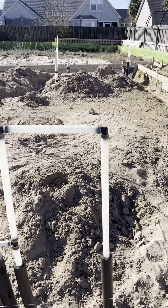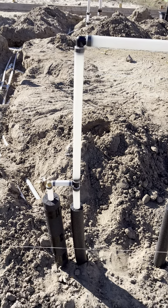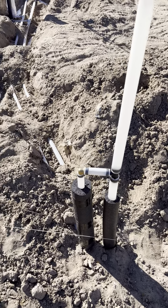We're going to go into a water softener loop, and this is going to go over into a water heater, then goes down. That's one-inch cold and three-quarter hot. It's a pretty small house, going from the heater out and over.